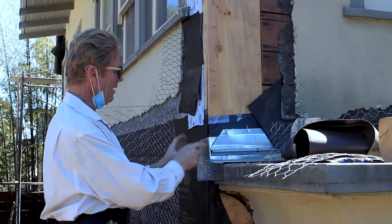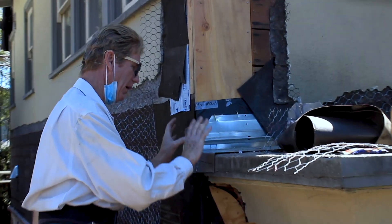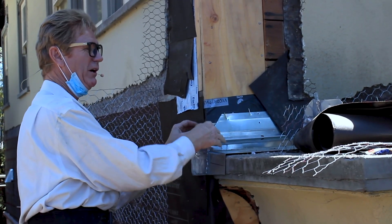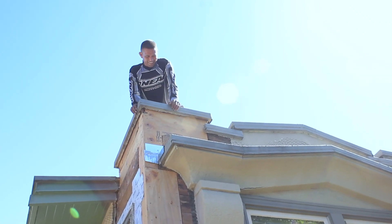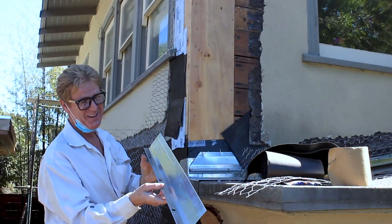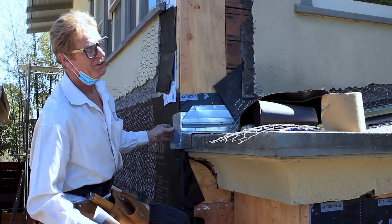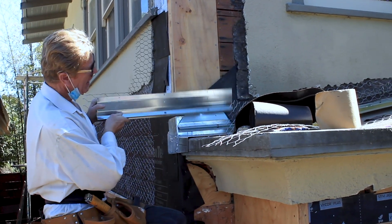Here's how you do these. Now if you have a saddle on this roof right here, it's done well. It's a flashing over the roof, and that flashing incorporates a saddle. Now what I do is I just hung this weep screed — this is a weep or a drip screed. This fella here who put the roof flashing incorporated his saddle. Now what we do is I have to counter-metal his saddle. So I've countered it, and I'm up about an inch from his.